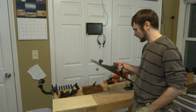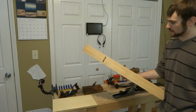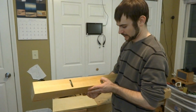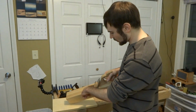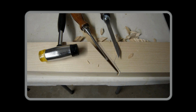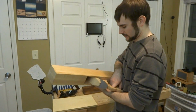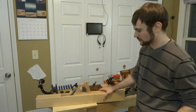It's just a plane that I'm using for doing that. And this one back here is a plane that I made out of 2 pieces of hard maple. It was 2x4, I guess, so 1.5 by 3.5, and I basically just cut out half of the mouth and the bed on one piece, cut it out on the other piece, and then finished it with a little Danish oil. Bird's eye maple tote, and it's big. It's big, it's heavy, it's a little bit too tall, I think.